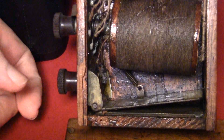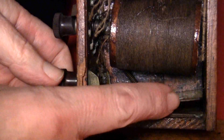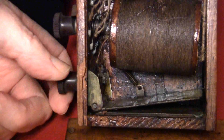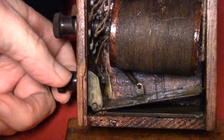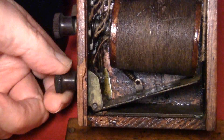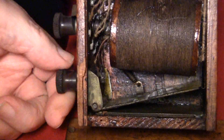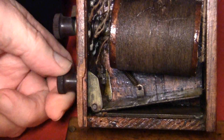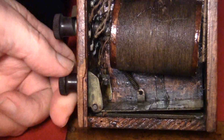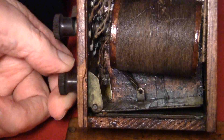Let's take a look at that book capacitor, which is right here. It's hinged here, and right here is one plate — the other plate is down here. When I move it in this direction, the capacitance between those two plates decreases. When I turn it in this direction, the capacitance between those two plates increases. It works very smoothly — really good job.